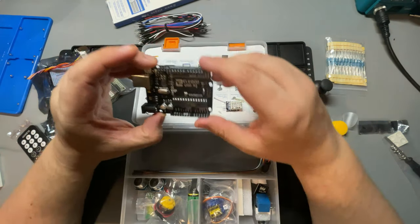Okay, so we can do that. We've got to put an LED in here with RGB. 220 ohm, not 220k, 220 ohm resistors going to these colours. Oh, I see, the wires have got the right colours, which is quite nice. So, yes. Okay. This all makes sense. Let's go and do that. Oh, we need to upload this to the actual thing, don't we? So, let's upload. Uploading done, it says. Right. Let's go and replicate this.